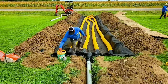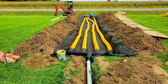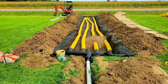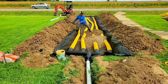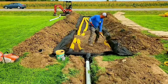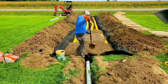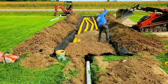If you see the knife cut right now, you see the four chambers. Picture putting pipe in between each one of those chambers — you're adding three more, and you want it to be perforated so you create these giant voids, more chamber, because stone fills in the voids. This sump pump system doesn't run very much, so I know I'm fine just the way we're building it. But most of the time we would put perforated pipe in between the knife cut, so there would be way more void. I wasn't containing very much water here, so what you see is all I needed. Other techniques include a longer leach field — the more water you need to contain, the bigger the leach field.